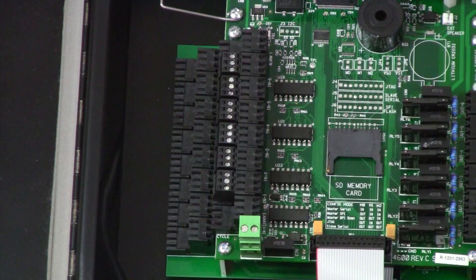There are a couple of different types of inputs that can be used on an SPR2000 system. The first type is a dry contact, which is just a switch closure. The second type is the use of a proximity sensor. The proximity sensor has to be 10 to 30 volt DC NPN circuitry. PNP sensors are not able to be used on the SPR2000 system.